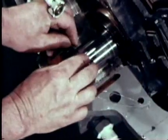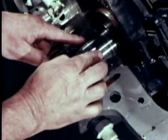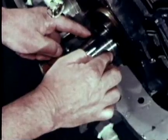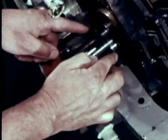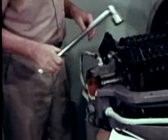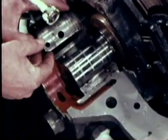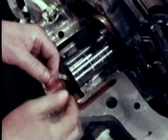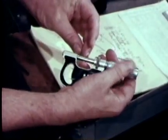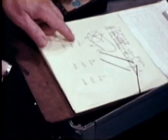The taking of leads during reassembly can provide clearance and alignment measurements often obtainable in no other way, as demonstrated on our sectioned turbo generator. Insert lead wires between the bearing and journal surfaces. Install the bearing, carefully checking alignment. Make sure the bearing is properly seated, then torque housing bolts down to the specified limits. Then disassemble the bearing and carefully remove the leads. Take and record micrometer measurements of the leads. A uniform thickness of lead along the bearing length indicates correct alignment, and the absolute value of the lead thickness indicates the clearance.